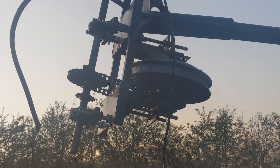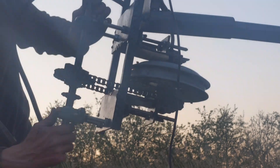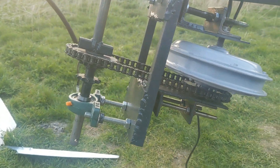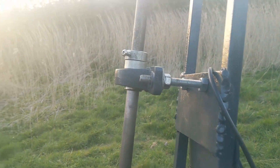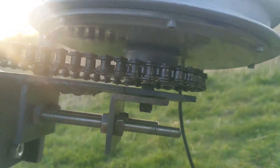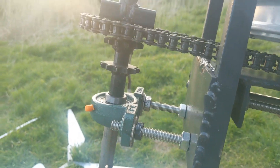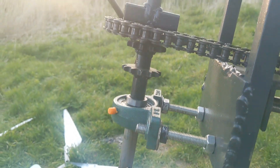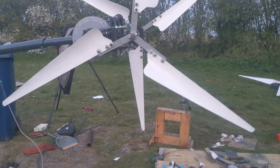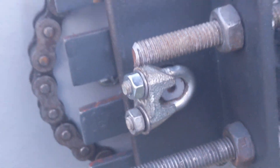Right, we're on the home stretch battling the sunset so I'm gonna try and get it finished now. She's looking pretty good — very nearly ready to go. You'll notice that I've got the bearings raised off, which enables me to tighten the chain, because I don't want to be messing around with chain shenanigans. So the motor's locked in basically as tight as it will go, and then we adjust the M12 bolts to tighten the chain, which also gives extra clearance to the blades. Hey, I reckon she's good to go — the chain seems alright, I've got everything held in. By hook or by crook — and that is definitely a by crook of that one.